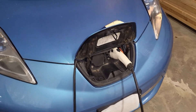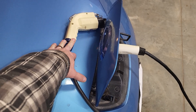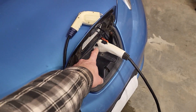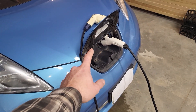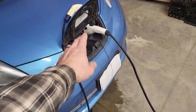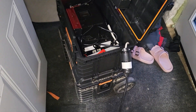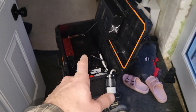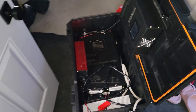Today we're trying something new — this is just my regular 120-volt charger for the car, and this is a 240-volt charger, a 3.3-kilowatt unit. It takes 3,500 watts to run it, and it's running all the way to my power box. We're going to see if this 3,000-watt Reliable inverter can run this 240-volt charger — it's going to push it to its absolute limit.